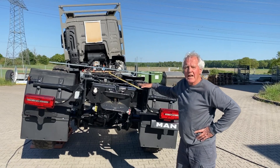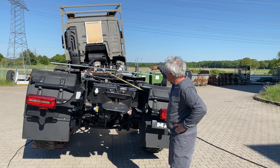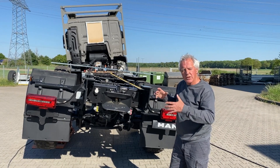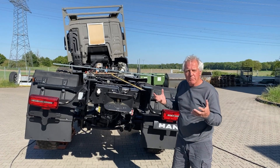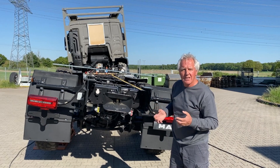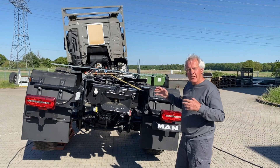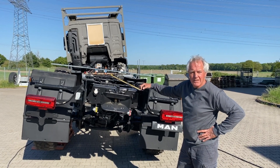This twist is happening even without having a body or any load on the chassis. Now imagine the body is solidly mounted on this chassis. One part is that the body will twist as well, and if you twist the body you will have damage — because the body is a very solid box, and if you twist a box it will break, and everything inside, especially furniture, will break as well. The other thing is that when the box is built quite solid, it will also constrain the chassis and reduce the twist. And if you have less twist in the chassis, you have less off-road capability.